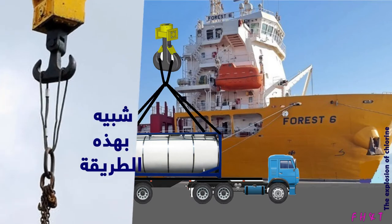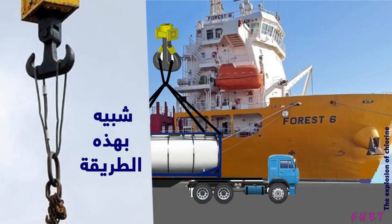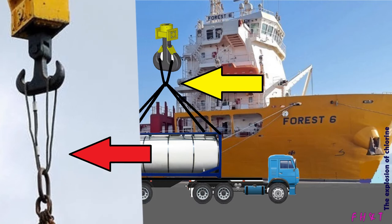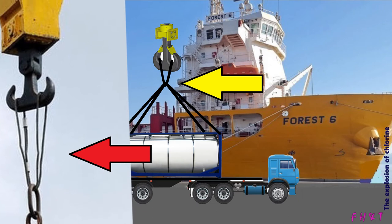During the process of loading and unloading, the whole wire — especially the part of the wire which is bent through the master link — suffers high stresses. The effects of bending, friction, fatigue, and endurance can be assessed depending on the wire's characteristics, the diameter of the master link bar, and international specifications.